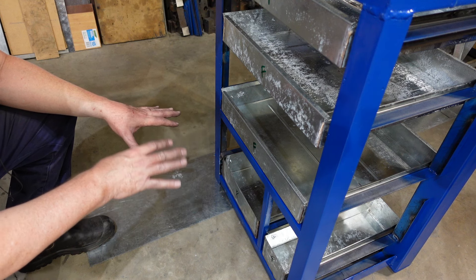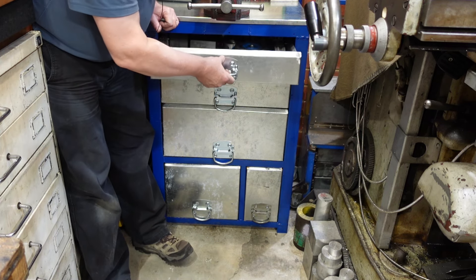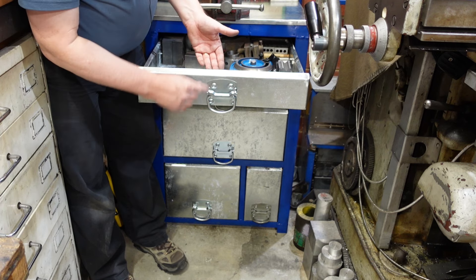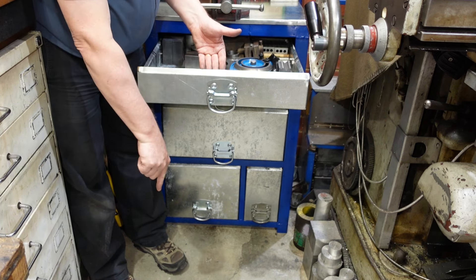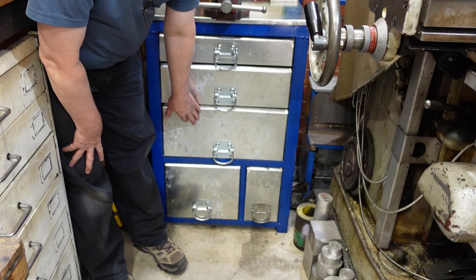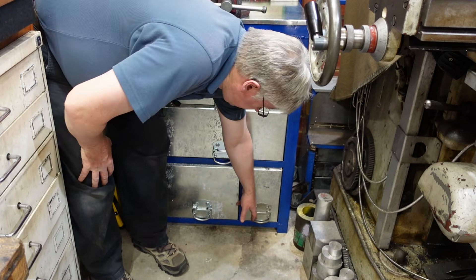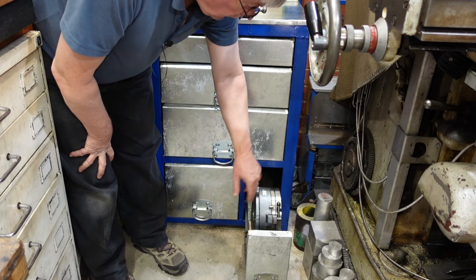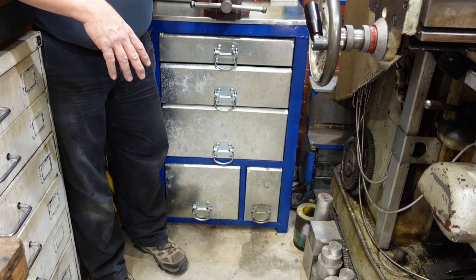When I checked my height and that sort of thing I thought it'd be nice if it was a bit taller. This is the end result — five drawers, rolling in and out quite nicely. The only problem is they need to be about twice as big, but I've got most of the stuff in here that I wanted. A point to note on the drawer fronts is that I've put a 45-degree slope back, and the hope is that when a chip from the mill hits that it goes on the floor and not into the drawer. This bottom drawer here for the rotary table — I can get straight down to that with the hoist, pick it up, and put it over here. So there it is — some revised storage for the mill. Thanks for watching, see you for the next one.